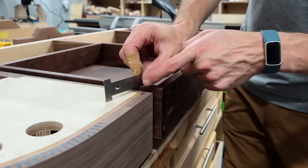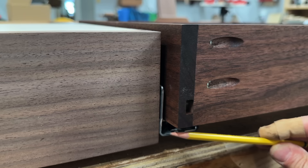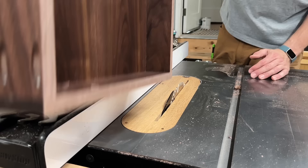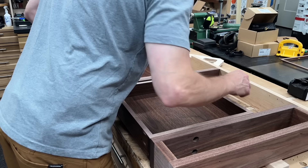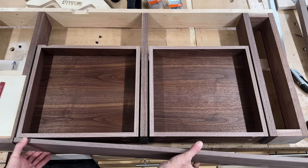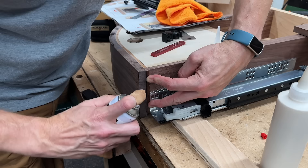I made them too tall. I can't hang the slides any lower - there's only about an eighth of an inch where the drawer front will hang down to cover them - so I needed to take off about five-sixteenths all the way around the top on the table saw. I forgot to film that, so here's a dry run showing what I did, then cleaned up the saw marks with a block plane. About an eighth inch below - crisis averted. One pocket screw was a little high and exposed the pocket, but I'll deal with it. What I should have done was put a stop block so the drawer front hits in two places and closes evenly.